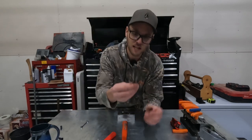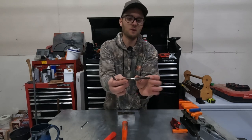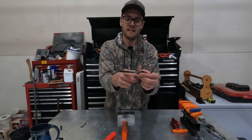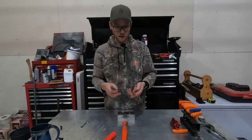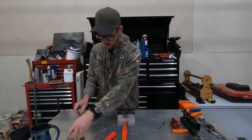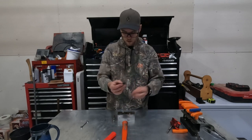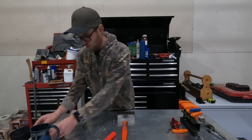These two studs are opposite each other — on one, the long end is a coarse thread and on this end is a fine thread; vice versa on the other. These flats had to be hand ground onto them and were checked for parallel. He checked everything. At least, that's how I remember it. It made for a good time.